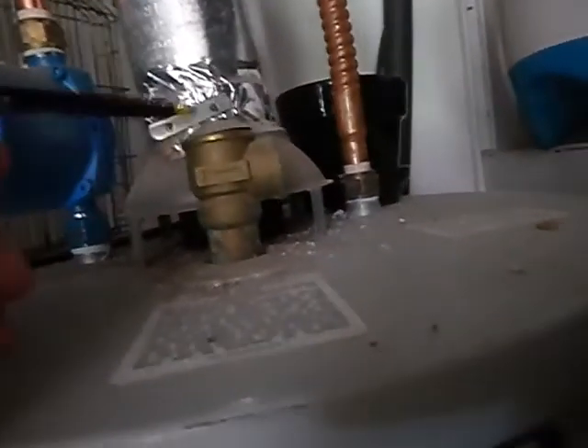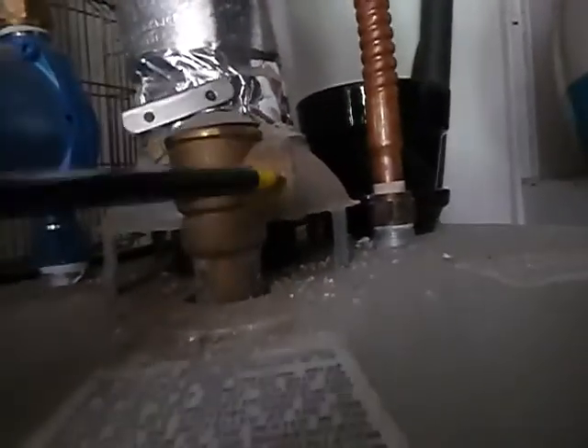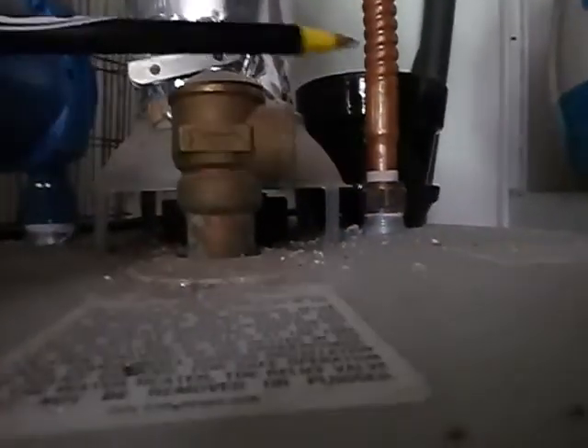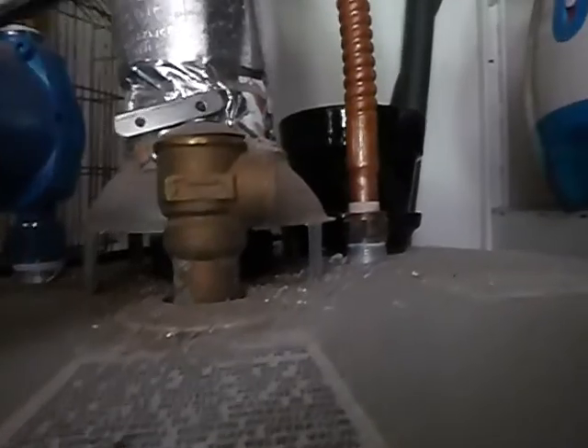The circulating pump is present. This is your temperature pressure relief valve and it should be insulated, just like these water supply lines should be insulated. They insulated some of it, but next to the tank this should all be insulated. Not only should this be insulated, but it goes nowhere — 200 pounds per square inch of 200-degree steam shooting out onto your bug spray can.